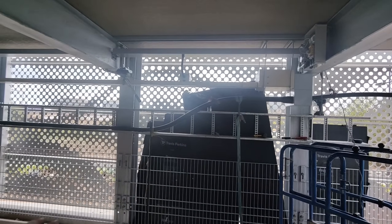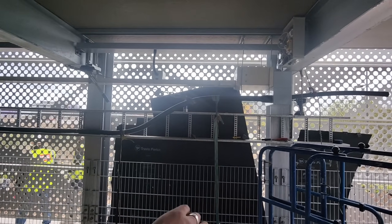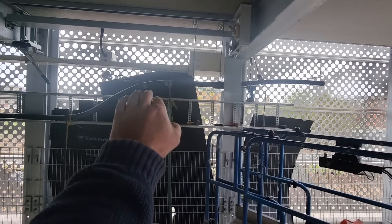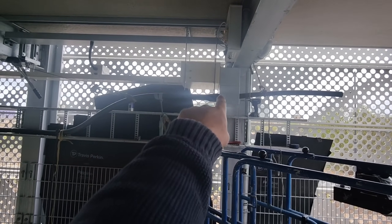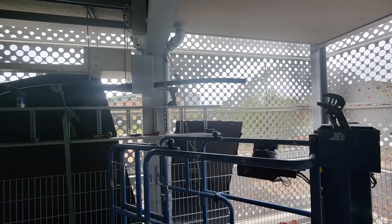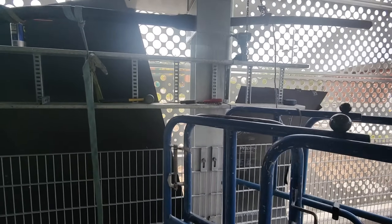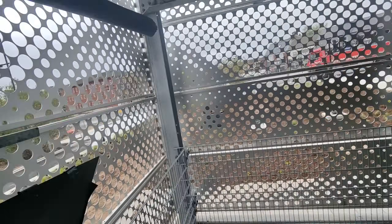Unfortunately for me I would deem that the easy bit. I've got to bend - see the letterbox they've made for me - I've got to bend these cores through that letterbox and onto the terminals which are there, five or six hundred millimetres away. I'm hoping that when I ring this I can bend each individual core sufficiently to get it through in there, and obviously it needs to be inside - it can't be sticking out or the lids won't go on. I'm happy with how that's gone. There's a slight gap - I need to tighten that lock nut. You can see it sweeps up to the set where I bent it down, then pulled it straight and bent it up at that end so it straightened it out into the box with the gland on.